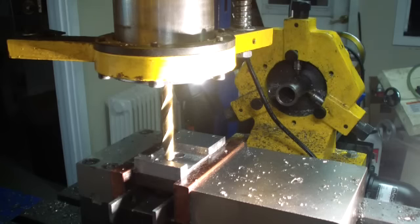This is the middle section of the crankshaft where the master rod connects to, and it's kind of got a throw to it compared to the front and rear crankshafts, which I didn't show all of the machining of those, but I did show some of it, and we'll show it when it's all put together. But what I'm doing now is drilling the dimension for a 3/8 inch hole. I'm at 11/32 right here, and I'm just going to ream it after I've drilled it out.